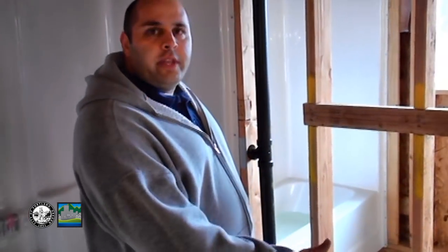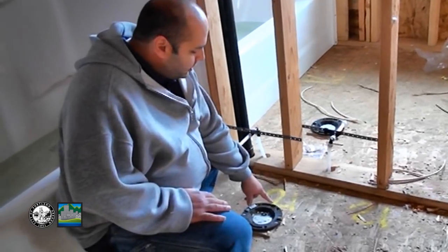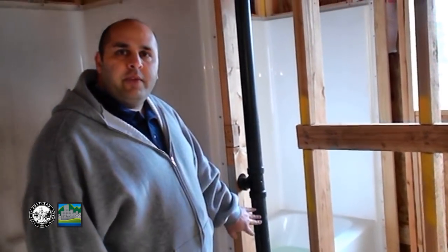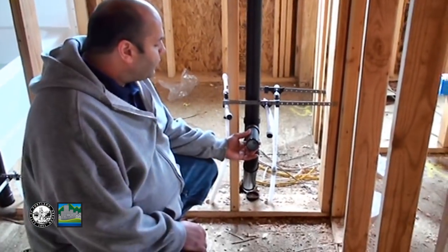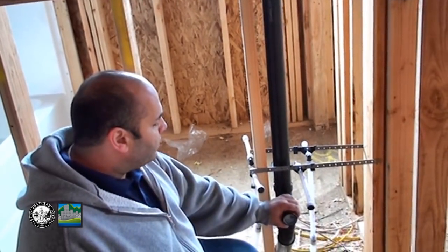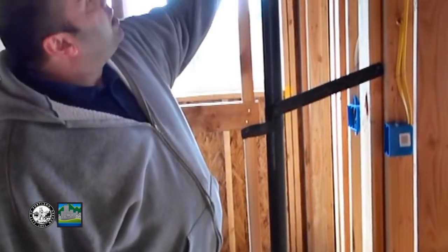We're here in the second floor full bath. This is a full bath because it has a tub or tub shower with the toilet and the bathroom sink. We're going to start back here at the flange — we're going to check for corrosion-resistant screws and make sure that all the screw holes are filled. We also need to make sure we have a cold water supply to feed the toilet. Then we're going to follow this vent up. In this situation we do not have a wet vent — this is just the vent for the toilet. This vent here ties in from the shower or tub shower next to it. We also have our drain line for the bathroom sink, the hot and the cold. This is actually a back-to-back situation — it ties into the one directly behind it, creating a back-to-back bathroom. They come together right here and then this creates its own vent going up and ties into that vent system.